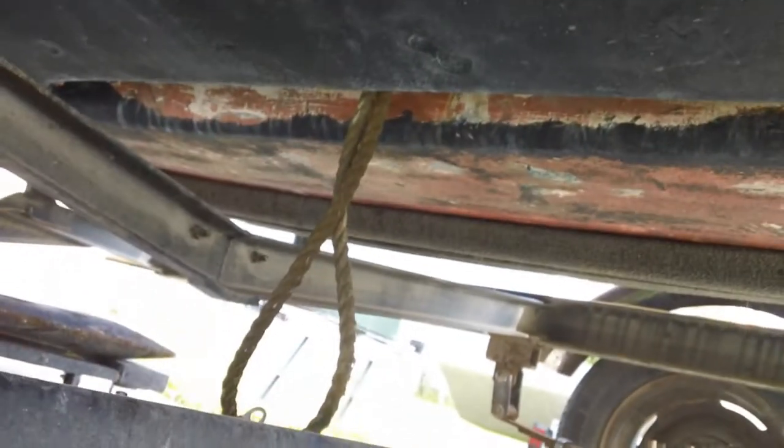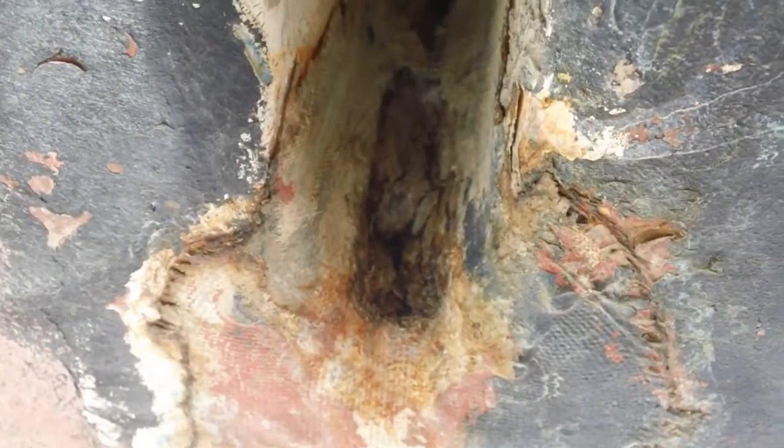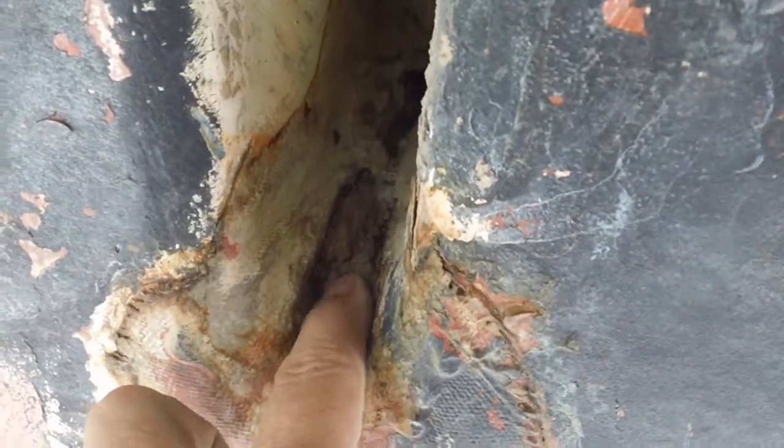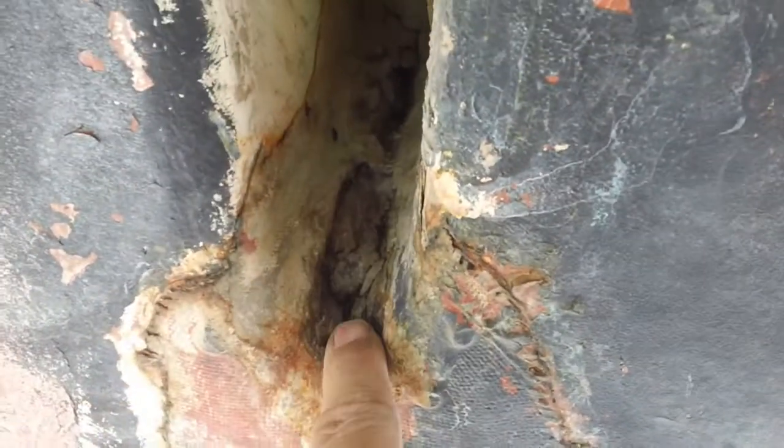And there's that rope that we showed from the top coming down to hook onto the keel. You can see the keel is not in there right now. So let me scooch up underneath here some. There's the forward end, and you can really see the damage where it's been tried to repair over and over. And this is where the keel actually swings down and slams into the bottom fiberglass here. And that's just in bad shape. It's going to be all ground out and completely rebuilt.